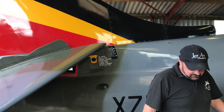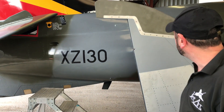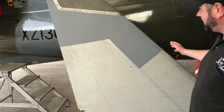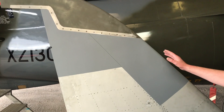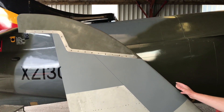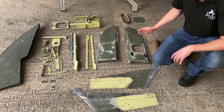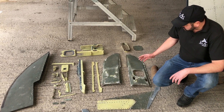I've come down the steps without falling over. What we've had to do for this project is we've had to turn the fin back to earlier spec and this is the end result here. There's a monumental amount of work gone into this — we weren't expecting it to take so long. You can see on the floor down here, this is all the structure which we've had to demodify and drill off. Each side has got over 300 rivets which we've had to drill out.